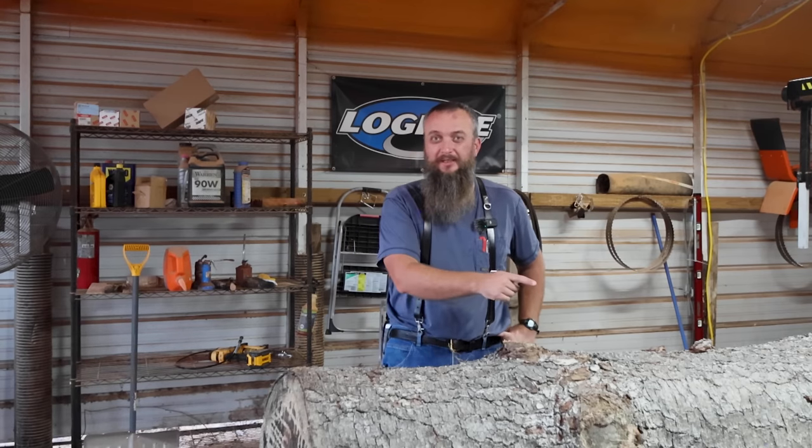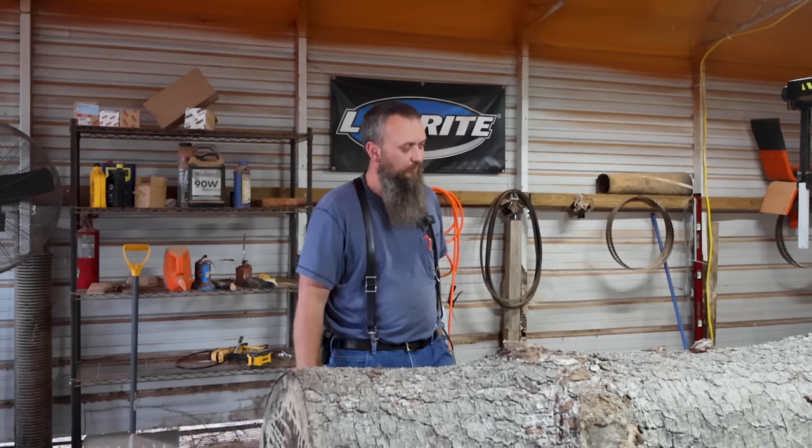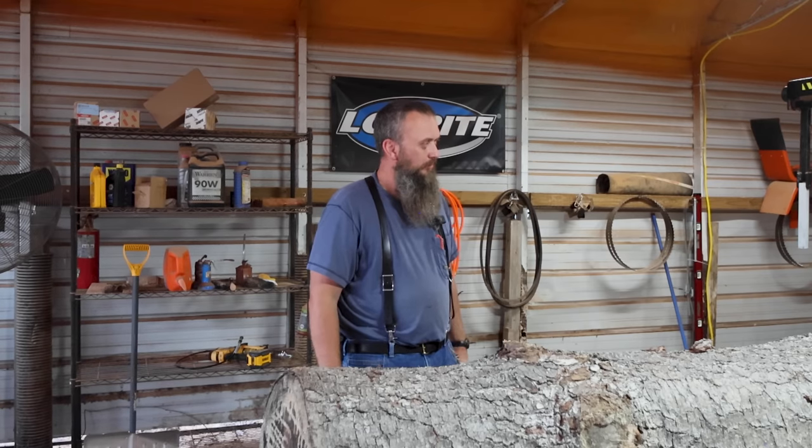And when you do dunnage, if you have some 4x4s with some wane, which means bark on the corner or the sides, that's okay. Keep going. And dunnage can be any size that you want. 2x4s, 3x3s. I've done 6x6s many a times, or 8x8s. I usually don't go bigger than a 6x6, though. I did 8x8s one time, but I can't remember why. But 4x4 is usually the standard that most people saw dunnage out of. So there we go. Now you guys know about dunnage and you've been educated.